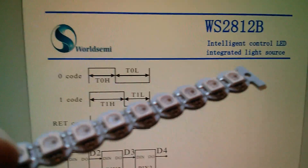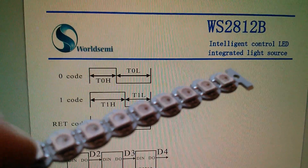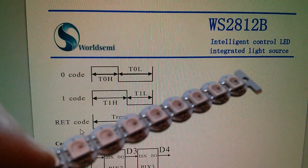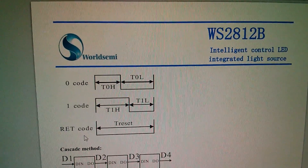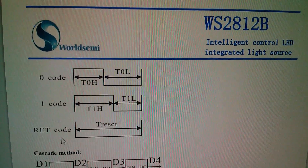So I thought I'd go for the simplest option, which is the latest chip, the WS2812B — four pins, five volt only. The five volts for the controller and the LED are one and the same. But when you start going through the data sheet, you realise that driving this thing is going to be quite complicated.